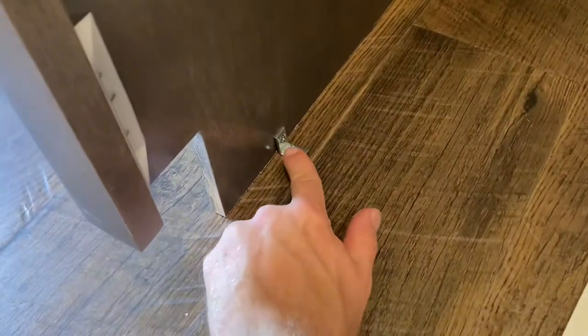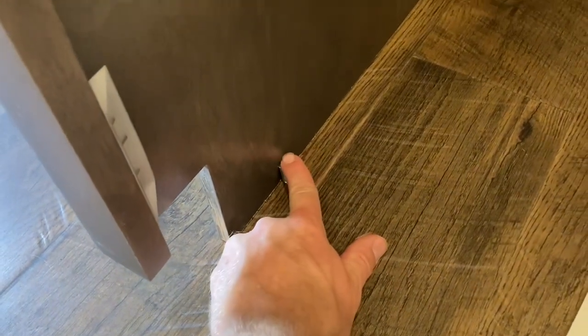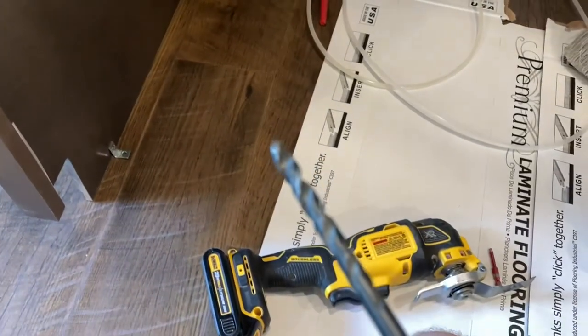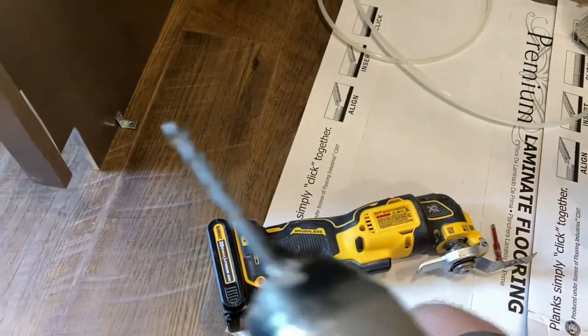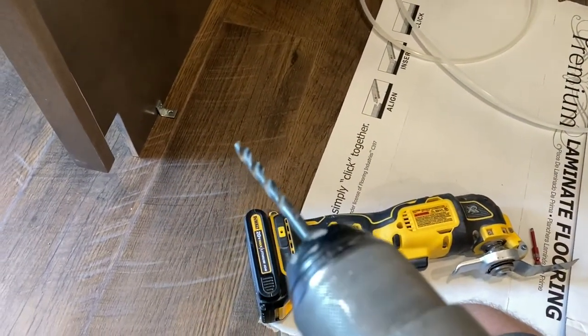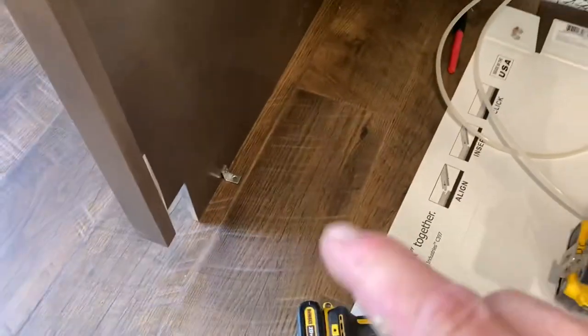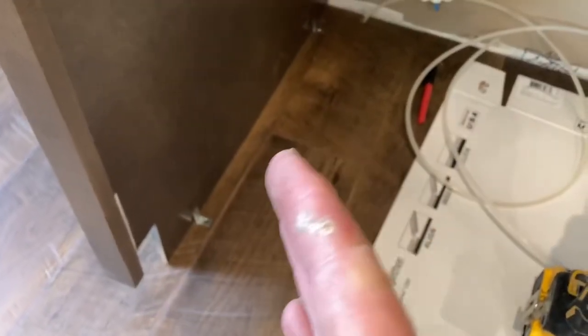What you should do is pick up these little L-brackets like this, with a short little screw to go into there, and then you're going to put one through the floor. The screw that you put through there — you don't want to screw right through your material. I'm using a quarter-inch drill bit. So I'm going to put a quarter-inch hole just through the material, not through the subfloor, because I want around that screw — I want this floor to be able to move a little bit.